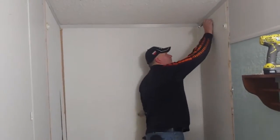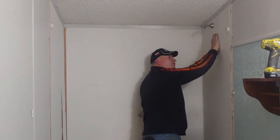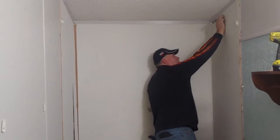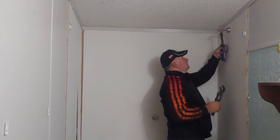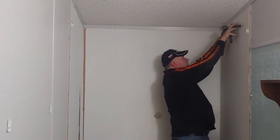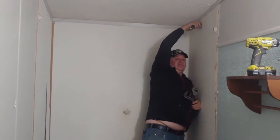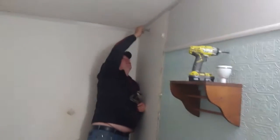All right, so you may have seen in a mobile home where the shower head's hanging down, the drywall's busted out, and I'm like, how in the world did that happen? Because a lot of times they don't use a drop ear elbow, which is fastened with 3 screws to a piece of wood that runs from one stud to the other. They just drill a hole through the drywall, and this side here is threaded. This side is threaded and it has a nut on the back side, so it just tightens up on both sides of the drywall. You hang stuff off of this and the drywall breaks and you think maybe the plumbing's bad. But it's just an inexpensive way of hanging it up.